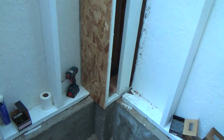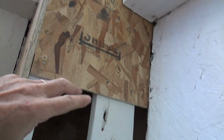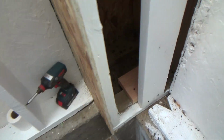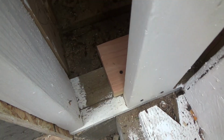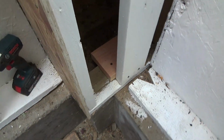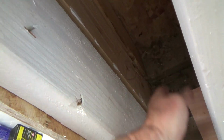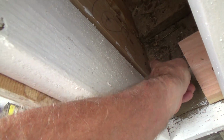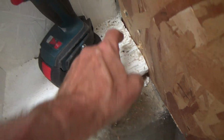It's been slow going. Everything is not level. This wasn't level up there, so I cut it, and I had to cut it twice, and that was off at an angle. This thing wasn't straight. This 2x6 was just flopping in the breeze, so I reached around and put a 2x6 block in there, pre-drilled it, and then put my liquid nails on it, you know, 2 little round circles, and mounted that, screwed that in. This 2x6 here was flopping in the breeze, so I had to reach down there, pre-drill 2 holes into that, and use long screws to get into this bottom plate.